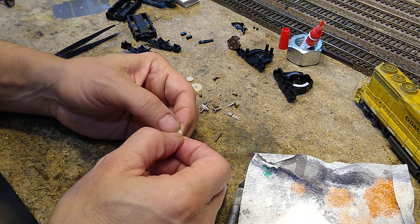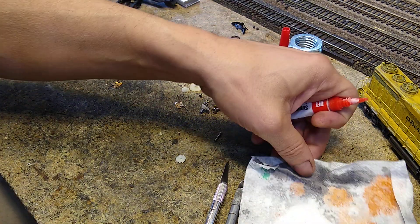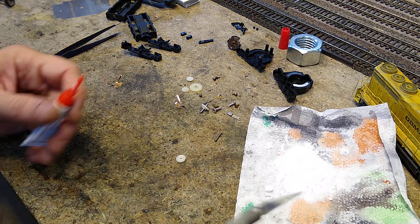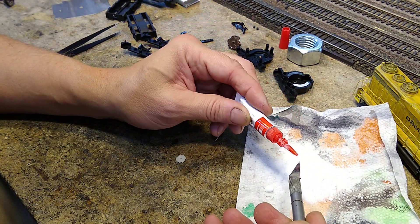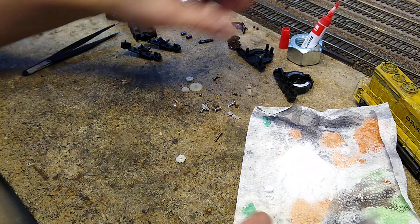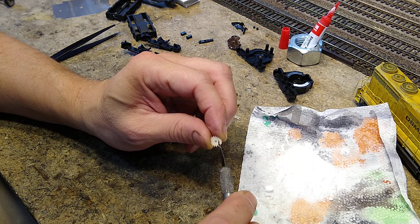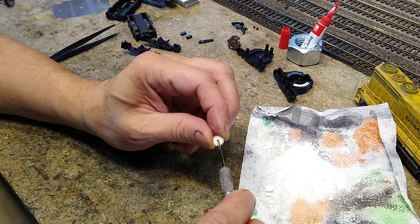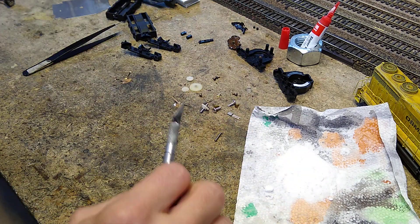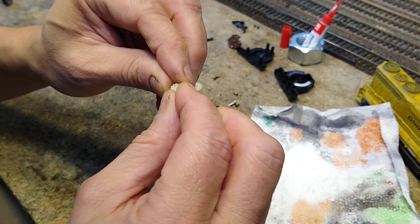So what we're going to do is find the spot with the crack — yep, there it is. We're going to take some super glue, and as always, I've got my baking soda pile here. Let's get a little glue out on the face. I've got some glue on there. Now I'm going to put the glue on the tip of this X-Acto knife. Very carefully, from the back side — there's a small gear on the front side — I'm going to wipe that glue right there, just work it a little bit. Already I've got too much, so I'm going to pull it out. We don't want too much glue in there because we're going to use the baking soda method.